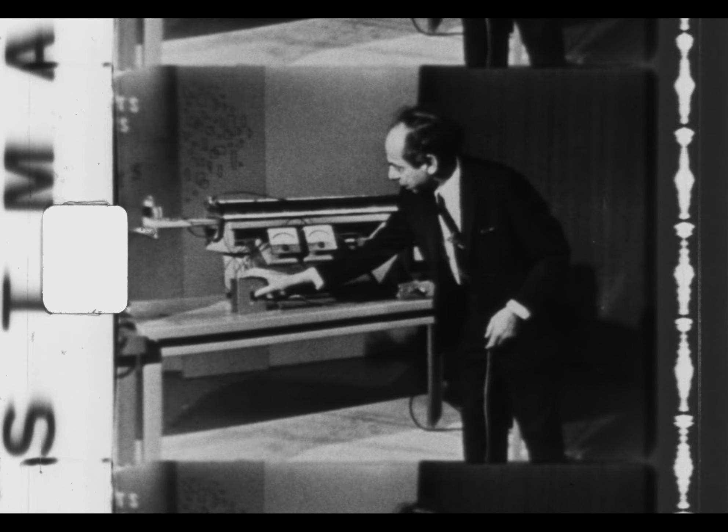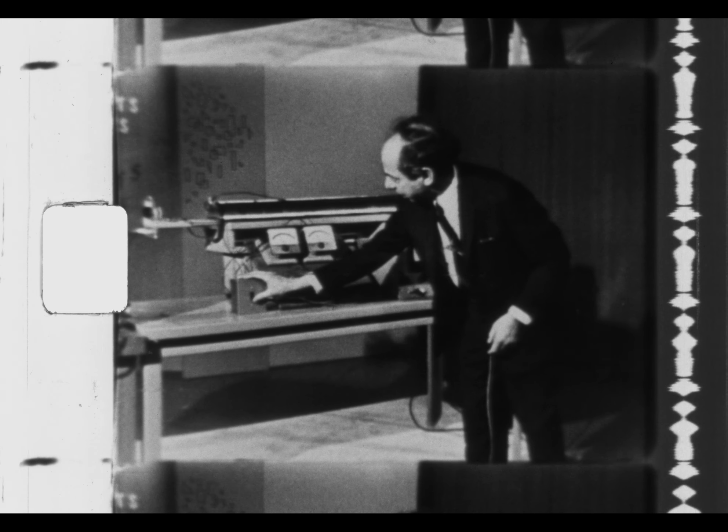Let's watch what happens when I raise this switch. This is a mercury switch, so one has to raise it slowly to keep the mercury from splashing. At some point the voltage goes right to zero, and when I put it down again, the current starts running through the coil. Since the current is large when it's shorted out, I wouldn't leave it in the shorted position any longer than necessary because things will get unnecessarily hot.